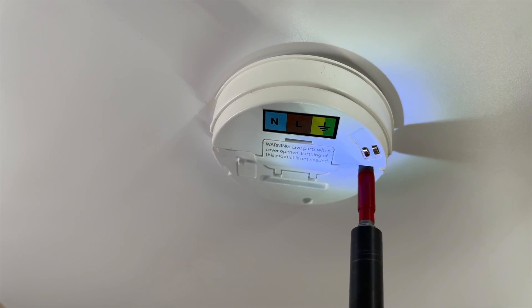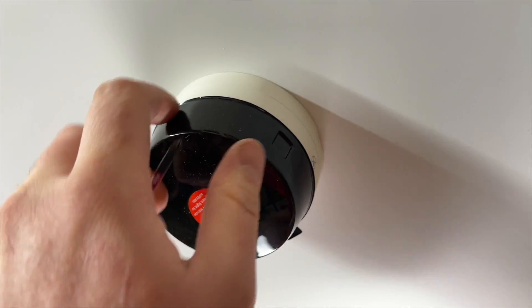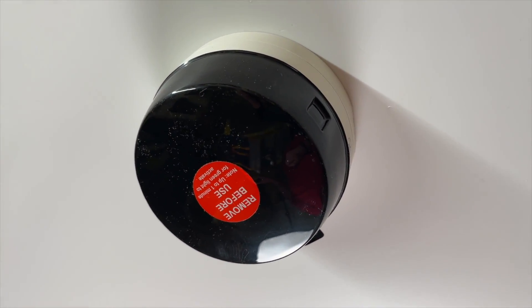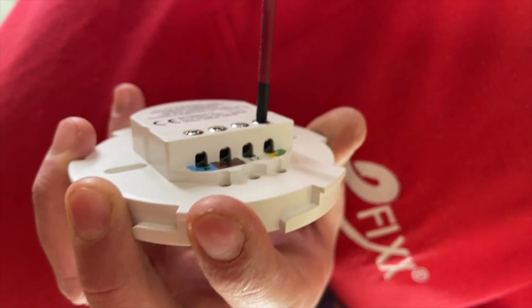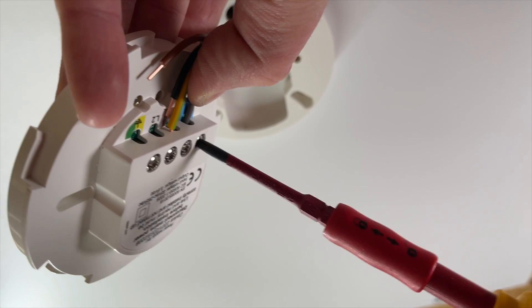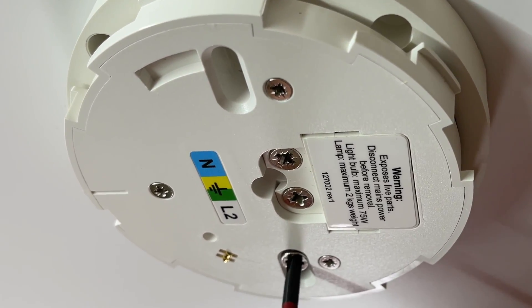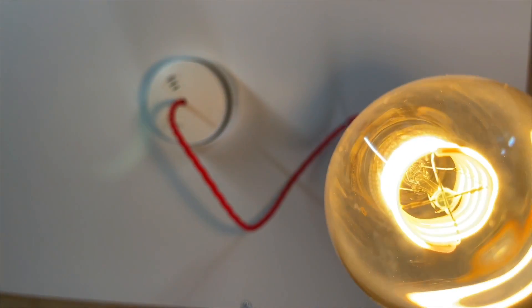The actual wiring is straightforward. There's a base fixed to the ceiling first, keeping the sensor out of the way while dusty trades are still on site, and a dust cap is available to protect units post-installation. The bases have colour-coded terminals, and the devices are double insulated, so the protective conductor terminal is only there for convenience if forming the installation as part of a lighting circuit. On the smoke alarm there is an L2 connection — that's not needed to link devices together; it's for the light fitting function we'll come back to.